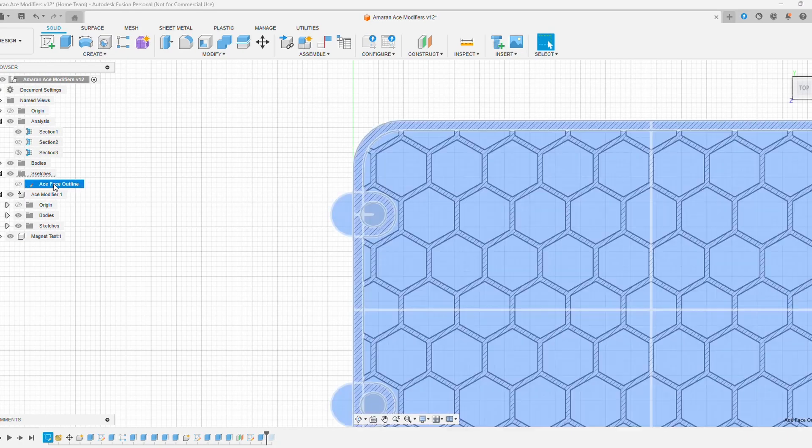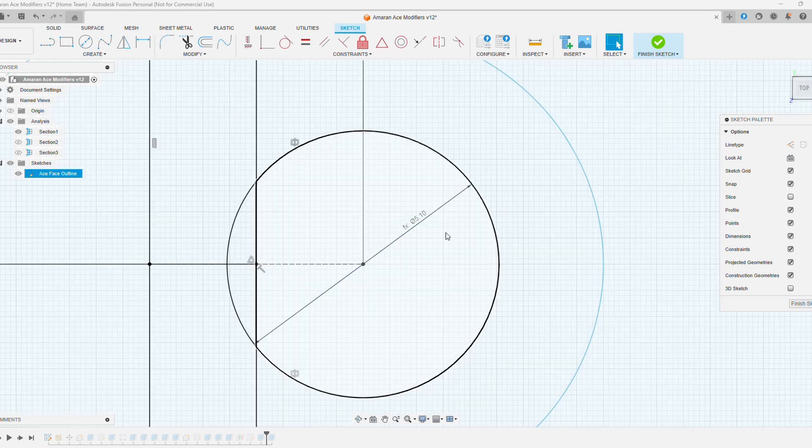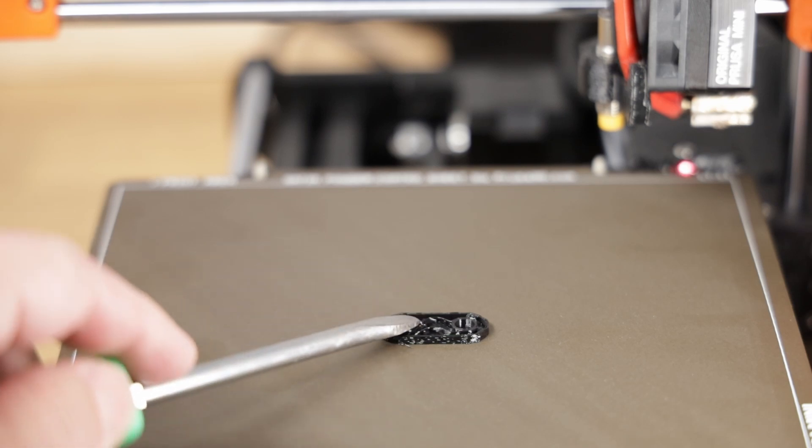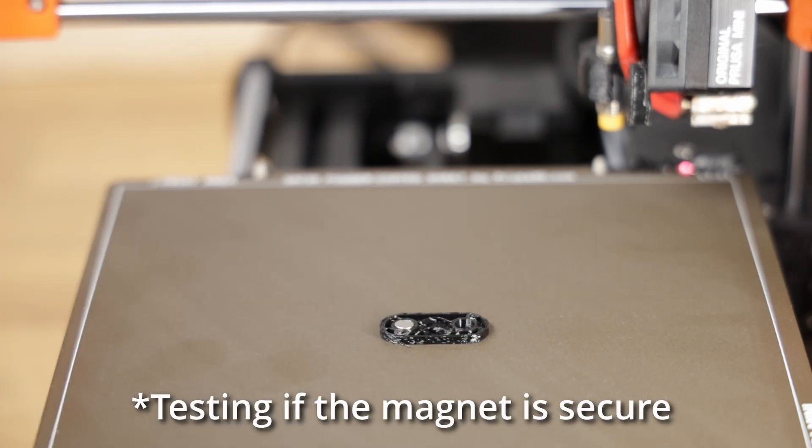Step number two: always add clearance when designing a cavity for the magnet. There's some chance that a 5 millimeter magnet won't fit in a 5 millimeter diameter hole, either due to variance in magnet size or the fact that your printer will most likely not be able to print a perfect 5 millimeter diameter circle. There are other factors like the extruded plastic expanding and contracting when it is deposited on the model. I like to start by adding a 0.1 millimeter clearance and doing a test print to verify that the combination of the filament type, my 3D printer, and the magnet will all fit nicely. Different filaments will expand and contract differently, so clearance for PETG might not fit the same as PLA on a given 3D printer — or it might. You never know if you don't test it first.